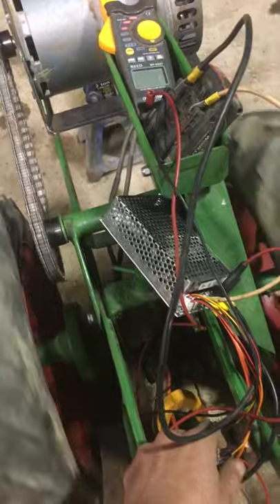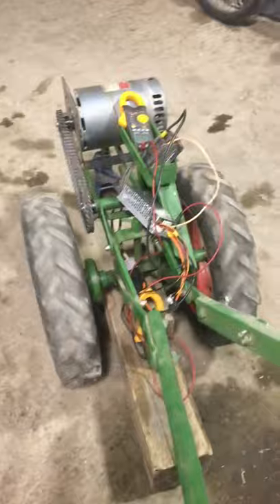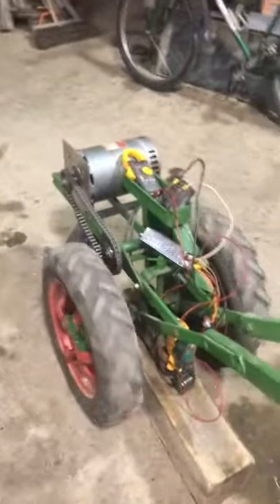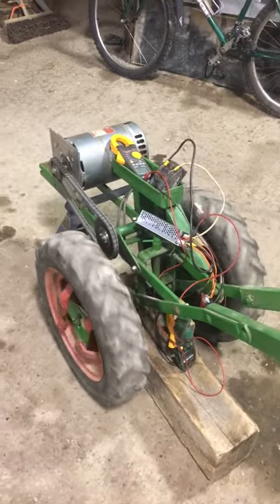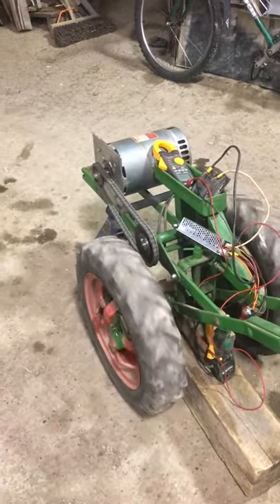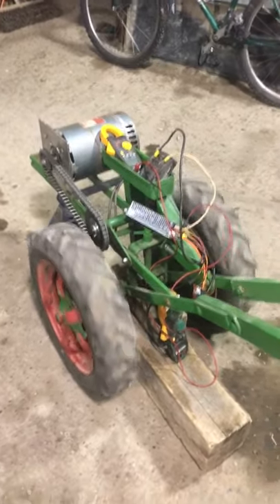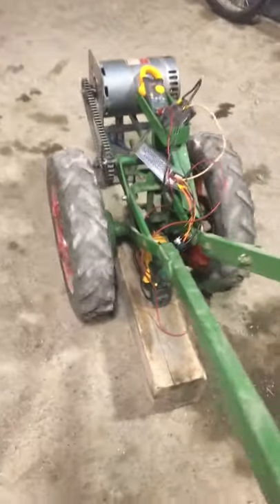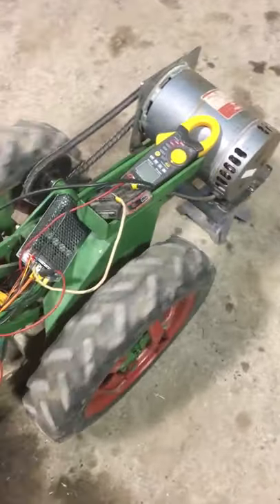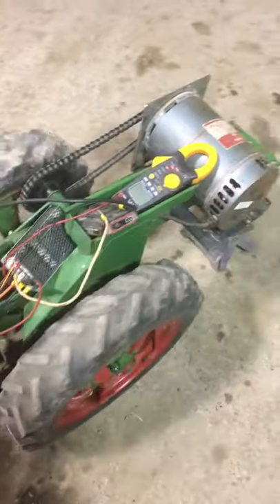What's 3 times 17? That's 51 watts. So it's only needing 50 watts to spin the wheels in the air. And if it's drawing 3.5 amps, then that little drill battery could do this for the better part of half an hour at full charge.